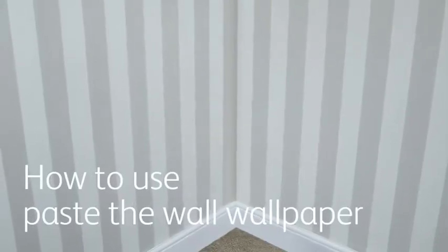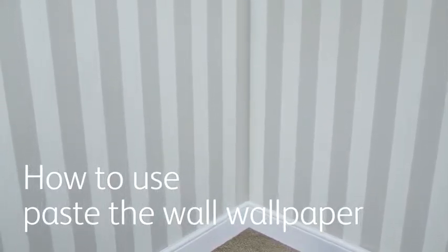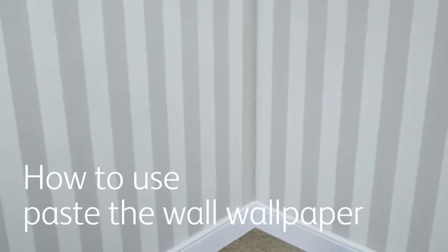Paste the Wall uses a special backing paper that doesn't expand when it gets wet. As you don't need to soak the wallpaper, the paste can be applied directly to the wall, which saves a significant amount of time compared to regular wallpapers. Therefore, Paste the Wall wallpaper products can be hung quickly and easily, cutting decorating time by half.